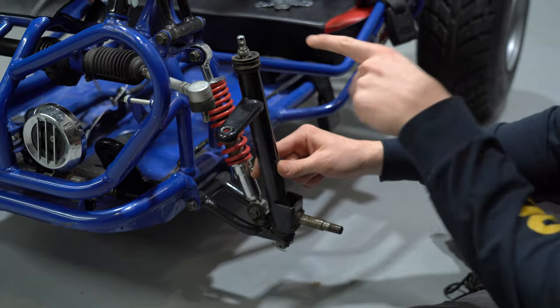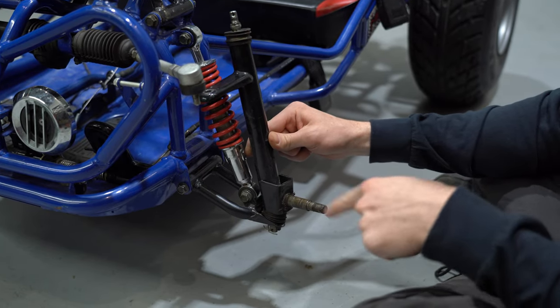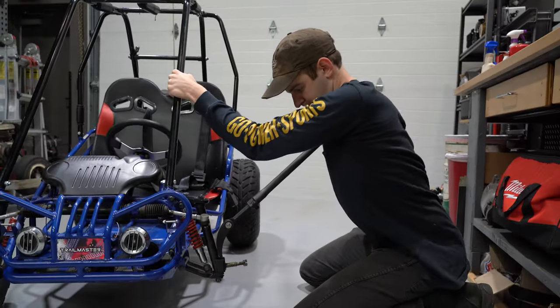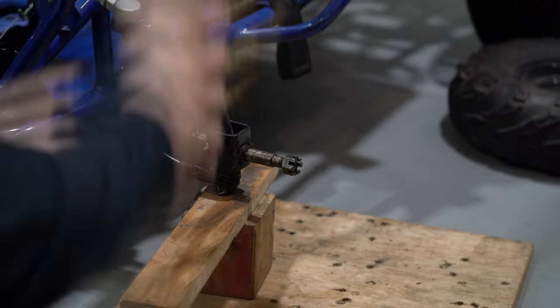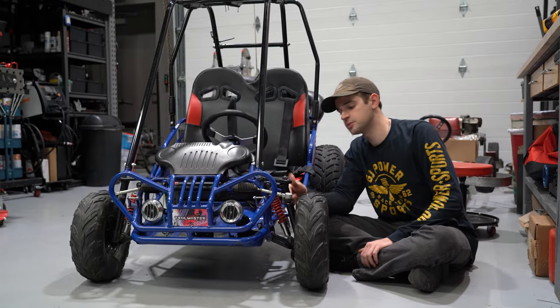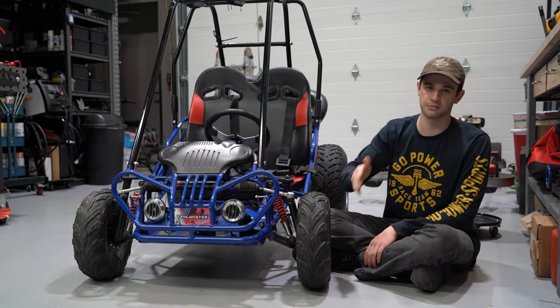I thought at first it was this ball joint, but it's definitely this bracket down here. It's bent a little bit forward and up, so we'll definitely have to strengthen this. We have nice clearance right here between our wheel and our spindle. We basically just match to the other side, so we have a little bit of positive camber.